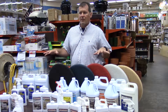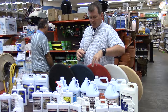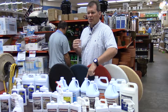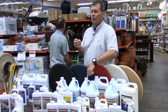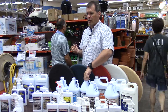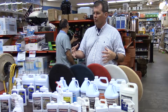Once you're sure everything is clean and really dry, on the commercial side, very old asphalt tile needs to be sealed — we don't see a lot of this anymore, especially over the past 20 to 30 years. With a porous old asphalt tile, you want to seal the floor first before you put your wax protection on. If you have a more current VCT tile that you know is not porous, you really don't need the sealer. But we want to be completely comprehensive in addressing everybody's flooring needs.